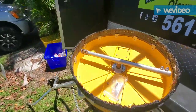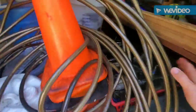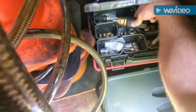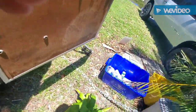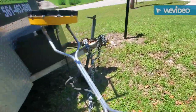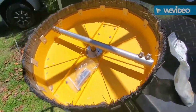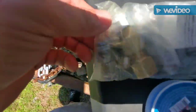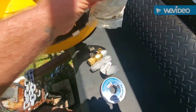I'm going to show you how to change the tips and explain why I like the four-tip Whisper Wash Classic. When you start out and you have a four gallon per minute machine — which is pretty much the minimum — and you get a classic 19-inch, you can actually clean with that. That's what I did. I had a four gallon per minute machine when I started, and I'll show you what tips I had in there.